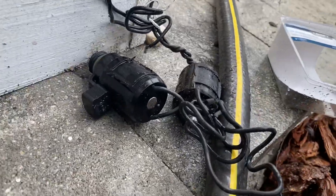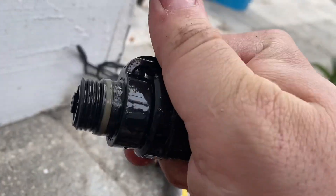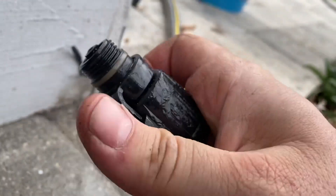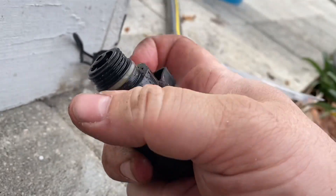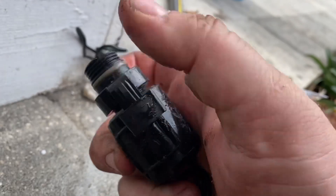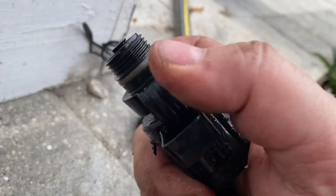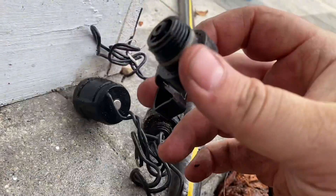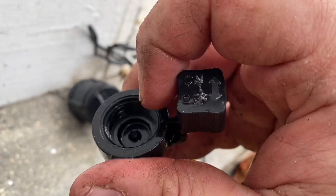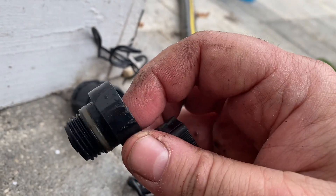It's because you need to use the existing switch. This little switch here threads off of this solenoid. Let me show you that. You're going to need to keep these. And check your O-ring status too — if that O-ring tears right here, you're going to need to get a new O-ring. So there's the old solenoid — that's what you're not going to use. This is what you're going to use. The DC solenoid will thread into here, and then this threads back into the valve.